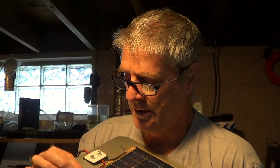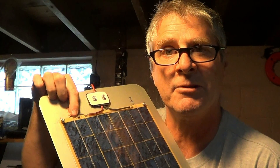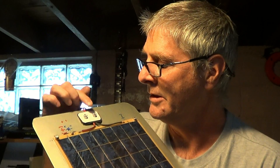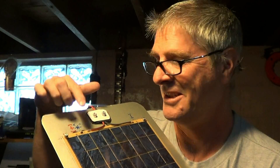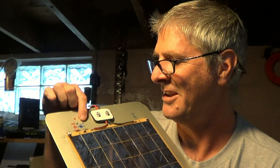For a better understanding of it: here at the solar panel positive lead, it's about 18 volts. Over here at the positive lead going to the battery, the battery's only going to be about 12 to 13 volts. So flow through the diode goes from cathode to anode — a less positive going to a larger positive, cathode to anode.